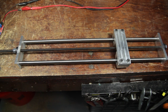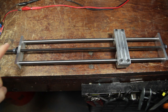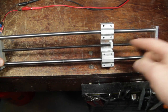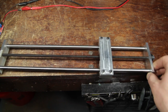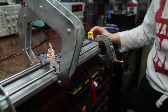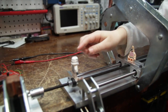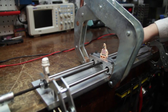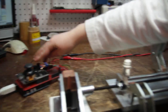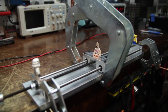We'll use a coupler also from Adafruit and hook it onto the shaft of our stepper motor and then onto the threaded rod. You can see my system right here — I machined a little block with a threaded component that slides the rails back and forth. My friend Matt is going to help show us how this works. This is Spongebob Squarepants, Patrick over here, and Luke Skywalker disguised as a stormtrooper. Pressing the A button makes it go one way back to Spongebob, and the B button goes to Luke Skywalker.